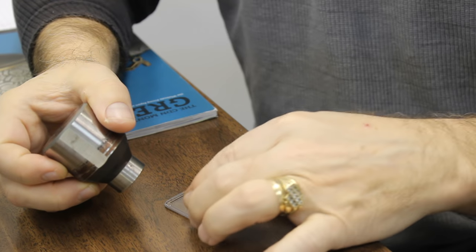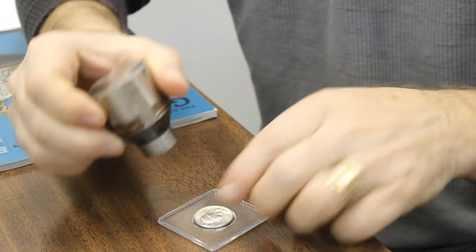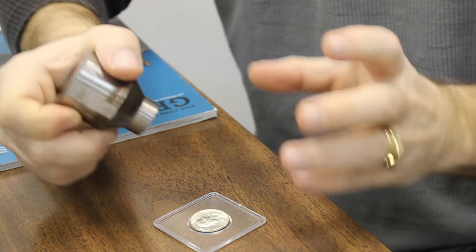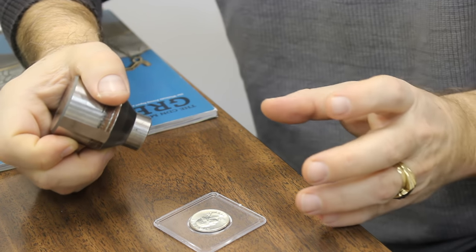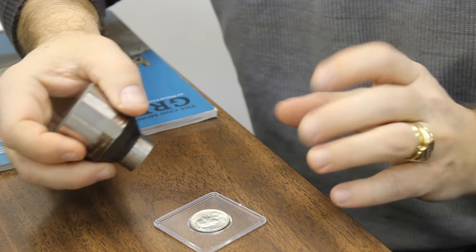It can be centered or it can be on the side, and it will spread out. As you can see, when the coin is seated in the coining chamber and the hammer die is striking these coins, they're being blown out, puffed out — it's happening so fast that you can easily get a conglomeration. You can get multiple strikes, you can get bonded pairs. I think there's been 11 or more coins bonded together at one time when they get stuck in the chamber.